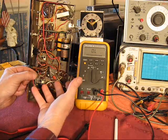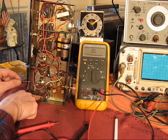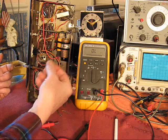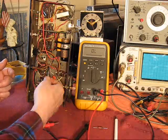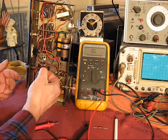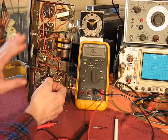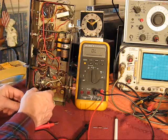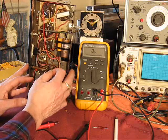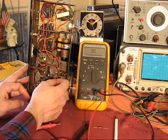With the voltage across it, where it is in the circuit, which is way up here in the front end, by the way, it was a source of grief. Off with it. A couple of 470K 20%ers, both within spec. But you get to the point where you're just going to shotgun the thing. I want to be done with this. I would like to not have to revisit it as a component replacement trouble.